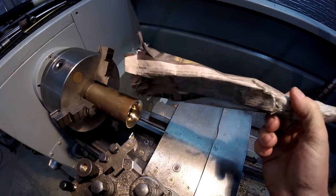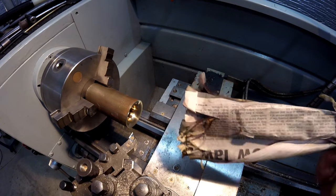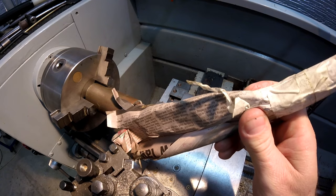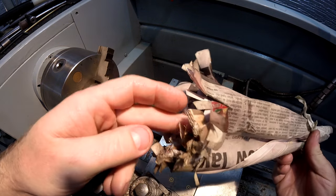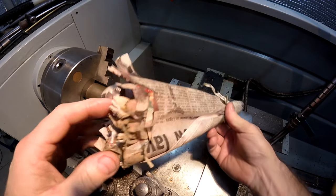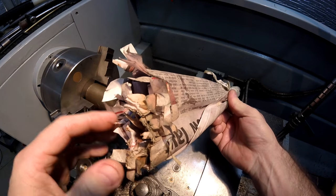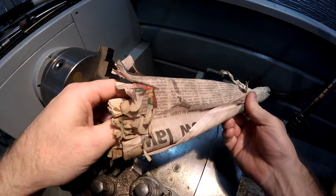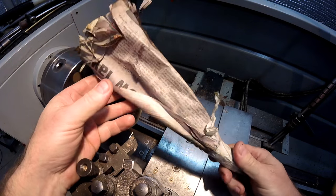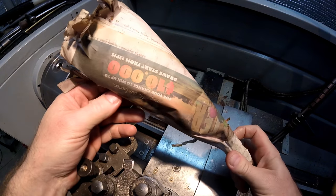And all you do is, when you're turning, instead of having brass going all over your lathe and all over the workshop, you just take that bad boy and stick it straight on the tool, just like that, and the brass goes straight up the inside and falls back on the bed. And you can take the biggest cut you like, and the lathe stays clean, you don't get covered in brass, there's nothing flying at your face. It's great. So make yourself a dodgy tool exactly like this one. You'll see how good it works in this video.